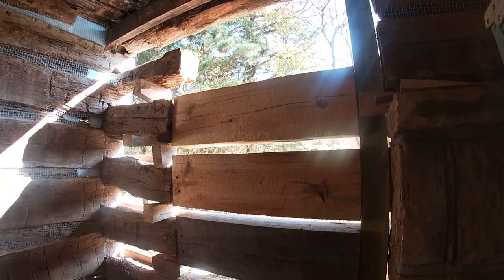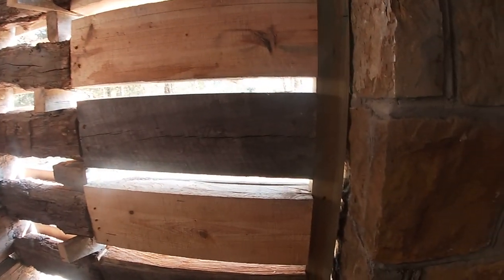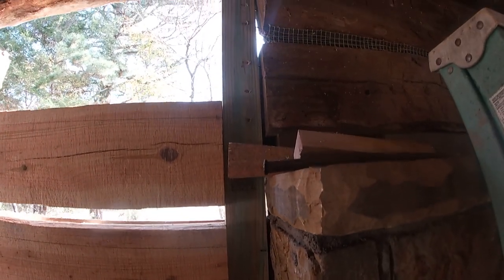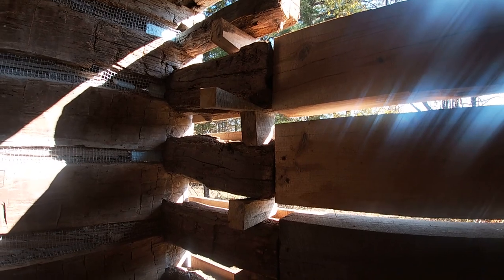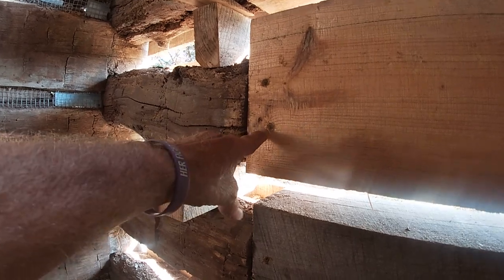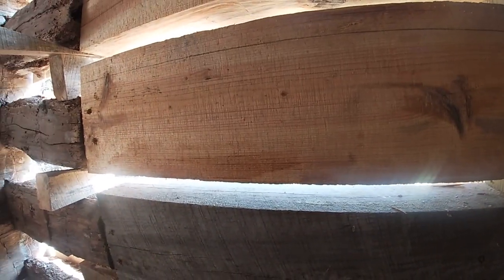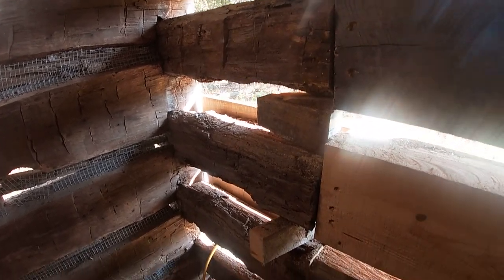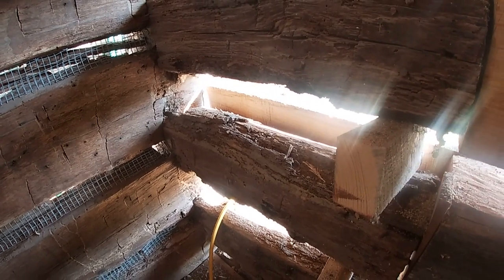I'll take you inside so you can see what I'm doing here. I've got these pine timbers that I made — they're five inches thick, just kind of an average of the thickness of the old logs — and I'll have to do some fill-in and fixing on them. You can see the 4x4 is all the way down. I'm screwing the ends of the logs together the best I can with some long torque screws into the ends, just raising this up as an average. I've had to put big wedges in just to hold these little short pieces up. You can see they're in pretty sad shape as far as the outside surface, but the insides are pretty solid.